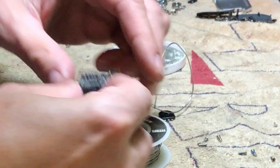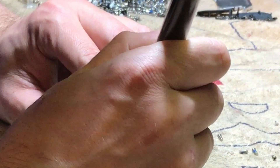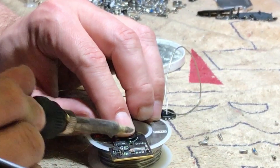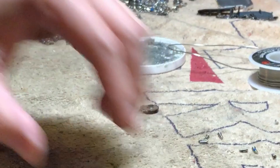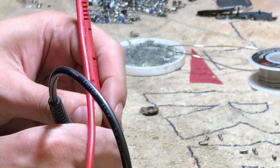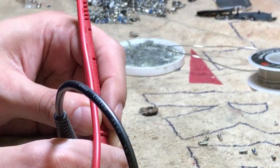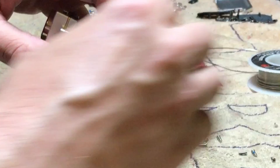We're good there, but this connector has no connection to anything whatsoever. I can't just leave it — I'm gonna apply solder to it just in case there's a little bit of copper underneath. I'm not sure if there is, but maybe I'll get lucky. And actually it is shorted, so we're okay. Now I'm going to measure the potentiometer to make sure I didn't damage it — 4k, 4k. Excellent, it's working.